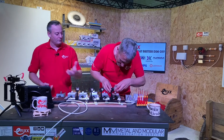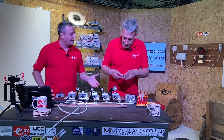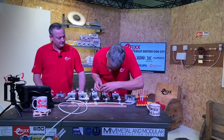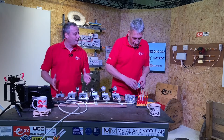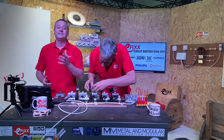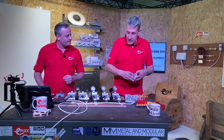The dimmable ones are a little bit heavier, though it's tricky because you probably wouldn't have both in front of you at the same time. Pop those in and we should see no flicker. So it's a legacy dimmer — we haven't changed the dimmer, all we've done is select the correct dimmable LED lamps.